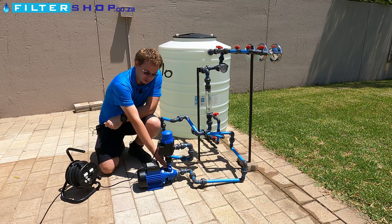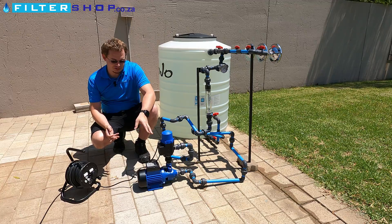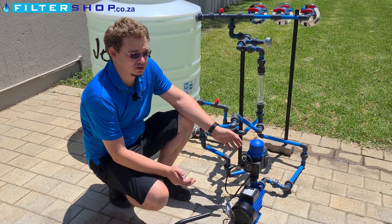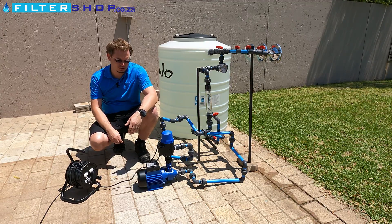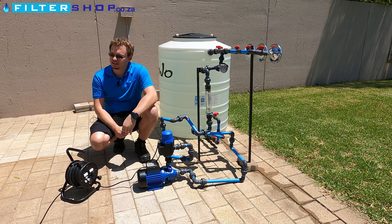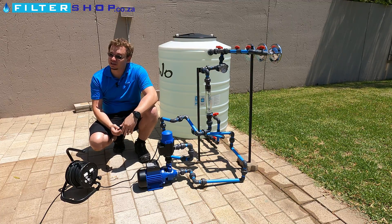It is a cast iron impeller setup. The very important thing to keep in mind with any of the cast iron pumps is you don't want to use corrosive water. If you have water which is either corrosive or the pH is below about 7.2, and there's any sort of a nick on the paint on the inside, it'll start to rust and eat the pump away, and then you don't get a great life on the pump.